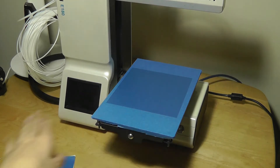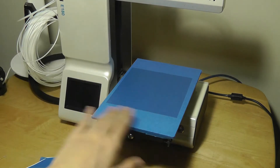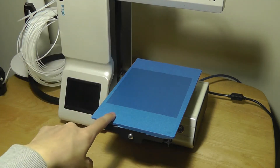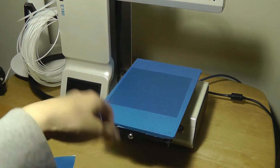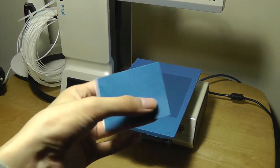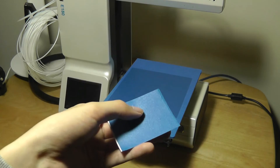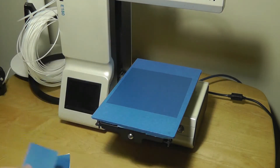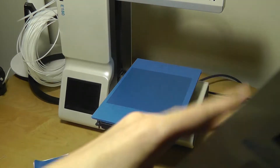That tape covers the aluminum because it's not a heated board. As a result, if the plastic is contacting something really cold, it's not going to stick very well and may create spirals and shapes you don't want. The tape provides a nice texture for the plastic to stick on as well as a more even temperature so that the print is more consistent. You also have access to an instruction manual.